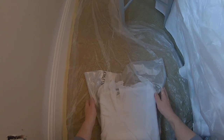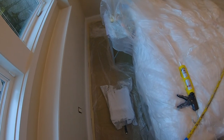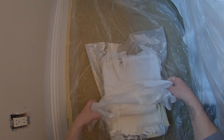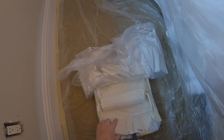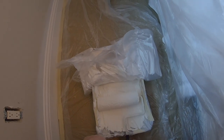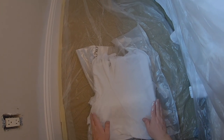The plastic and the wet rag create a seal to keep it from drying out. If you have to wait a long time between coats — say a couple hours — come back every 15 or 20 minutes, pull it back, and saturate it. You want to keep this upper area nice and wet; if it starts to dry you're gonna get chunks in your paint. Come back and visit it often.